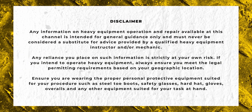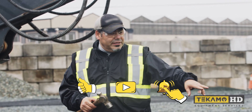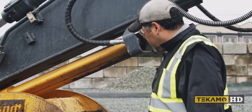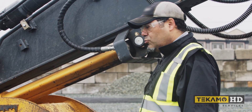Today, I'm going to show you how to check buckets, bucket bolts, and then we're going to check the cutting edge on our blade as well. Because of the wear, it's in a very high wear point, so we can't really go in there with a wrench or socket and check the tightness or the torque of it.